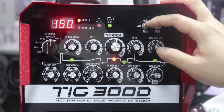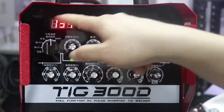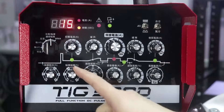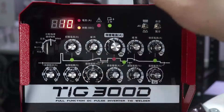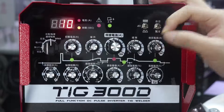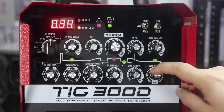First, I suggest adjusting the welding time — switch to the middle position and adjust it there. The welding time is fully digitally presettable. Switch to the down position to set the welding time value. If you set it to 10, that means 10 milliseconds of welding time, which equals 0.01 seconds — much less than you can control manually.